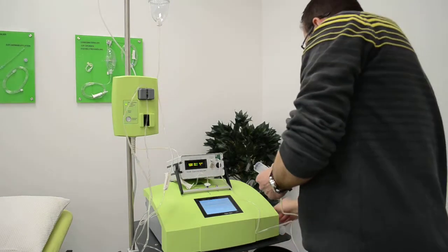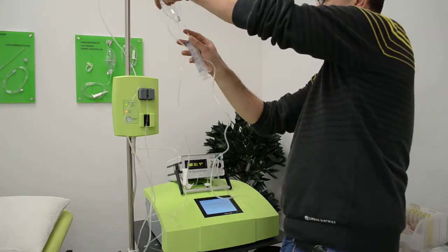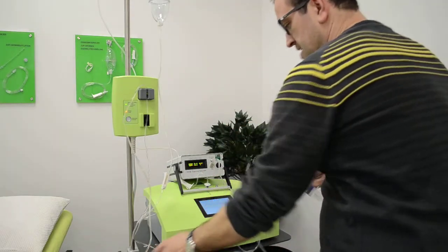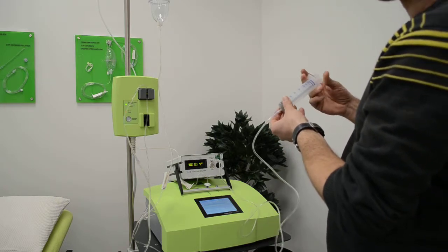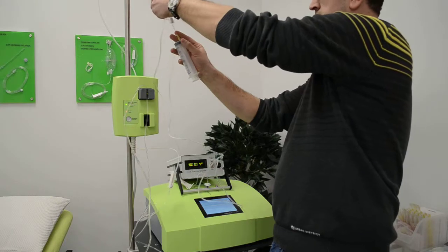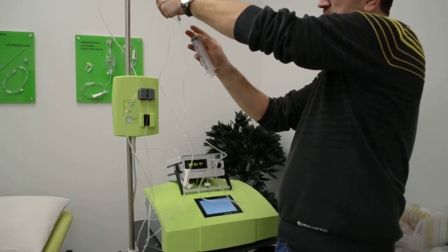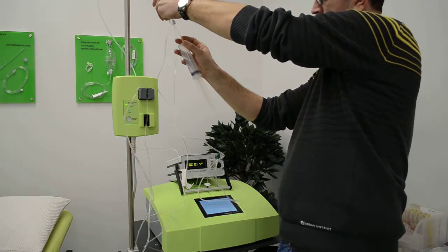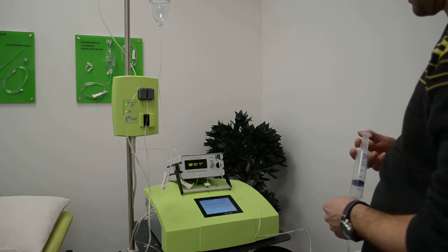Let's do that again. Taking the syringe, inserting the needle into the side port, going to the analyzer, pushing it in — 67. So it's quite accurate, completely within tolerance. Let's do it a third time. You can also hear when I go in that the pressure drops and the device creates more ozone to raise the pressure again. And the last push — 66.6, 67, 68, 9.